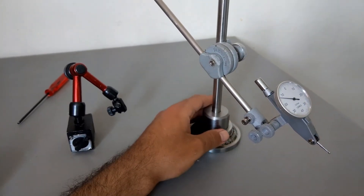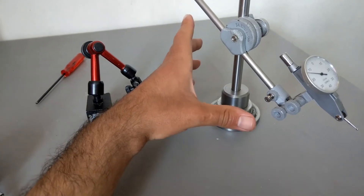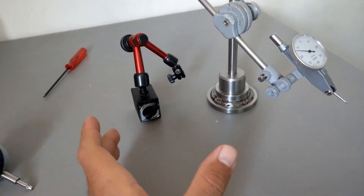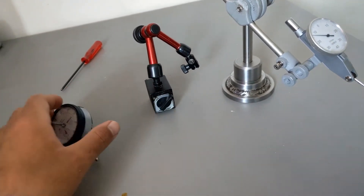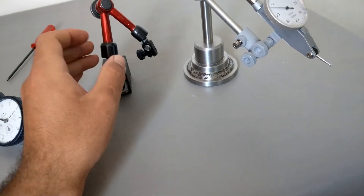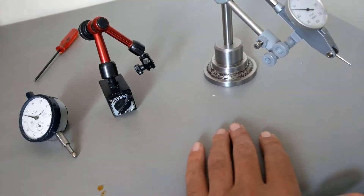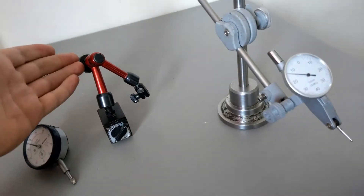The reason I built this dial stand is because I sometimes try to measure parts over flat surfaces which are not metal, so I cannot use a magnet stand. It's not heavy enough — if I put my dial on and try to use it hands-free, like leaving it on a table, the dial is going to tilt over. And any time I needed to use it on a table I had to stick it to a piece of disc or a steel plate to keep it steady.